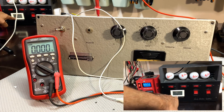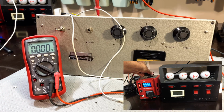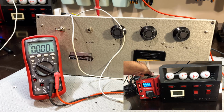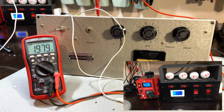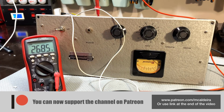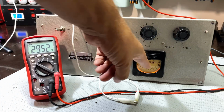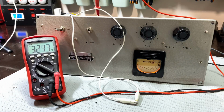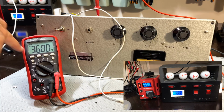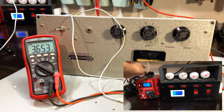At 0 volts, that thing won't come on. It needs some voltage first. So let's see what happens. I've got a limiter on. I've got one light bulb. Switch that on there and see what we get. I'm going to put it up to about 50 volts. 2 volts over there. Aha! That's come on. That's definitely come on. So the dial lamp is on. The other winding that just supplies the dial lamp and the rectifier tube's heaters is working. Not sure what voltage we're getting there, but this thing's definitely too low. And it's at 50 volts, so I'm going to go up a bit more.